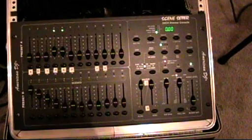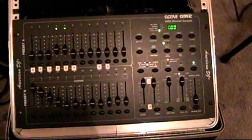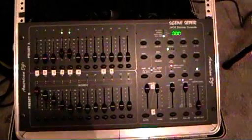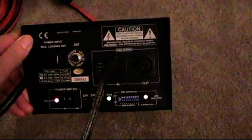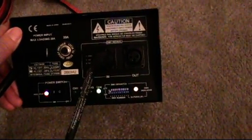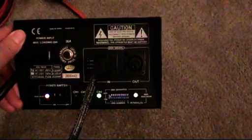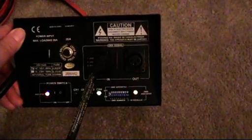So what does this thing do? Well, it is actually an extremely low power unit. It's plugged into a very simple adapter, but then a microphone cable runs out from that to something called a dimmer pack. This is a dimmer pack, and that microphone cable carries a signal of all those different fader switches to this box, and this box distributes the power out. You'll see a plug is plugged in. You can daisy chain them together, and they digitally recognize what channel is set for what.